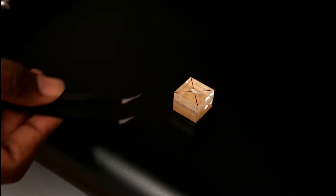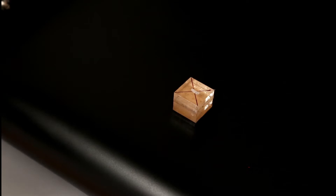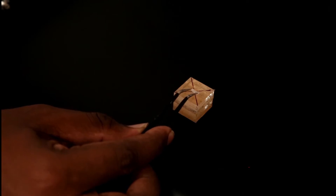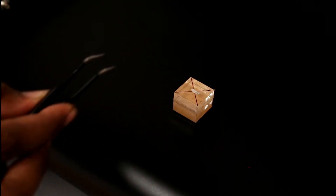This is the test piece used for calibrating the machine. This test piece is delivered with the Magnic machine for calibrating purposes. In this test piece we have placed a 2 mm x 0.25 mm small metal pin, which is the scope of the machine. This is the minimum resolution which the machine can detect.